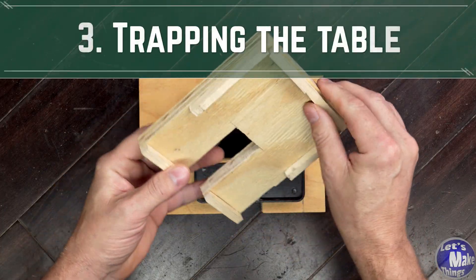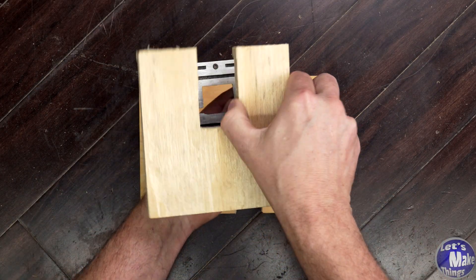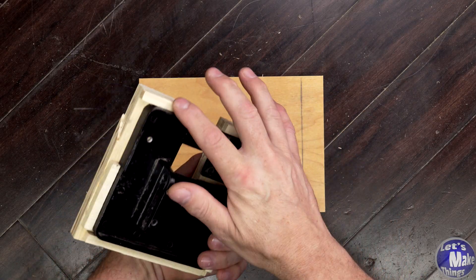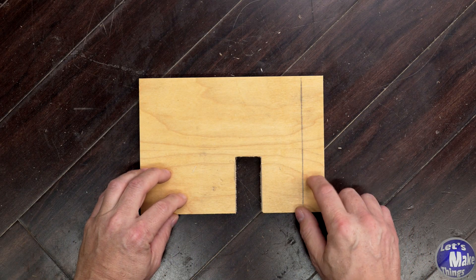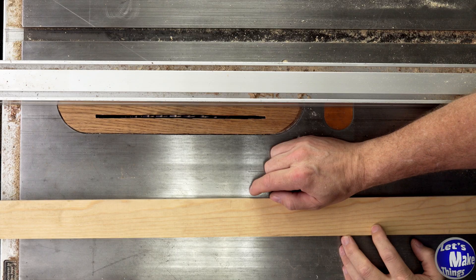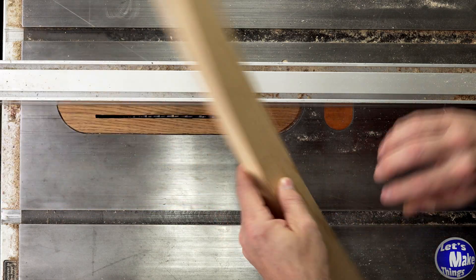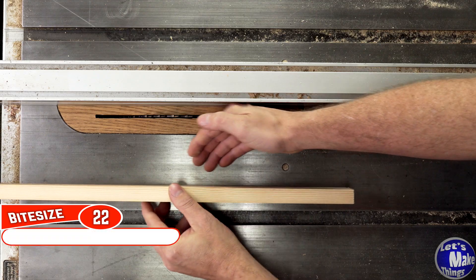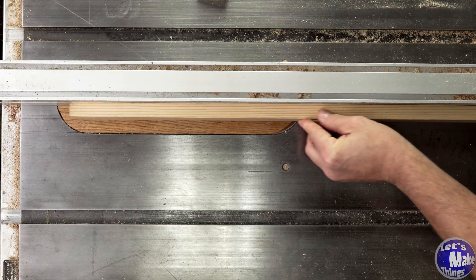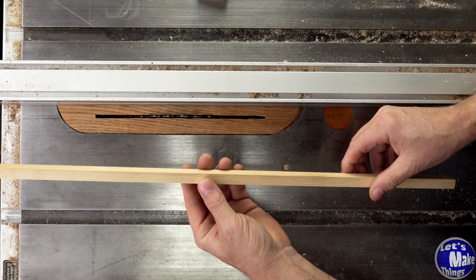With my prototype, you can see I've added some strips to the bottom — it just makes it easy for me to attach it and take it on and off without having to add a knob or screw to the bottom. So right now we're going to cut these strips out, and these are going to be half inch by half inch. We're going to go to the table saw and make a really quick square dowel. I've got the table saw set at a half inch away from the blade, as well as the blade being a half inch. I'm going to make a cut, flip it, make another cut, and then my square dowel should magically pop up at the other end. And we've got an exactly half inch by half inch square dowel.